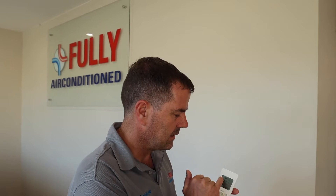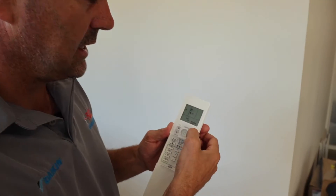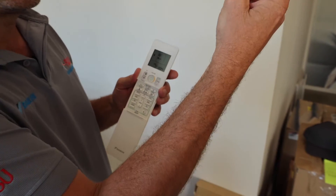Then use temperature up and down again until you get the long continuous beep on the second digit. For example, if H was part of the fault, each push gives a double beep until you hit the right combination — say H9 — and then the unit emits a long continuous beep. Doing it this way brings up more codes than just using the cancel button. Do the cancel method first — it's simplest. If that doesn't work, try the second way.